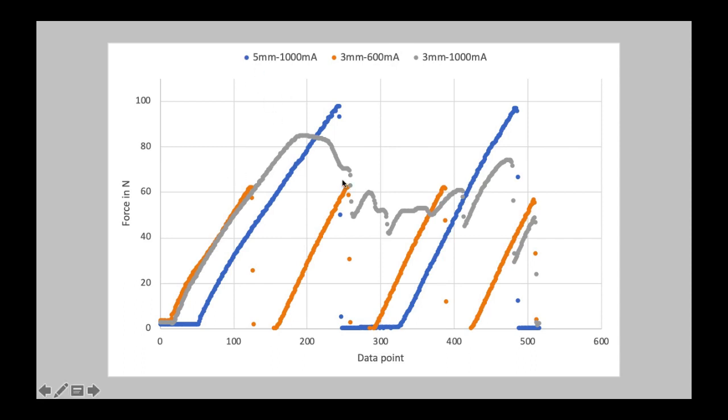Another issue with running averages was that when stripping occurred, the strip and regrip effect wasn't always the same. Sometimes it regripped quite well and could push up again to the same forces it had before, giving a higher average in the end. And sometimes it completely failed to regrip and lost all torque, and then you got these fluctuating numbers that just didn't make any sense. So what I did in the end is use the 20 highest numbers, in the hopes of getting just a few newtons lower than the absolute maximum the run would usually peak at, if you know what I mean.